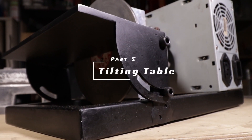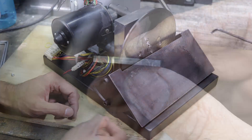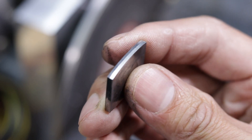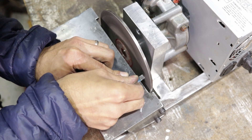Part 5: the tilting tool rest. This one goes from minus 5 degrees to 45 degrees. Though adjustability is not strictly necessary for sharpening scraper blades — since a fixed 5-degree angle is all you really need — it does make the machine a lot more versatile for sharpening other things like lathe tools and carbide inserts.